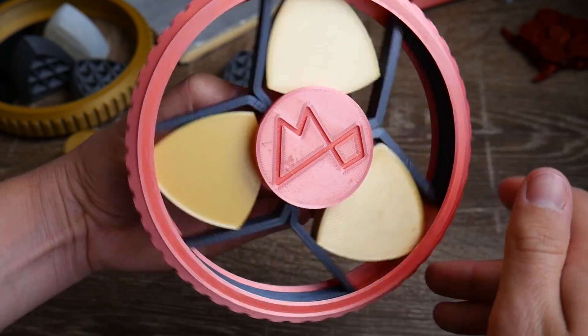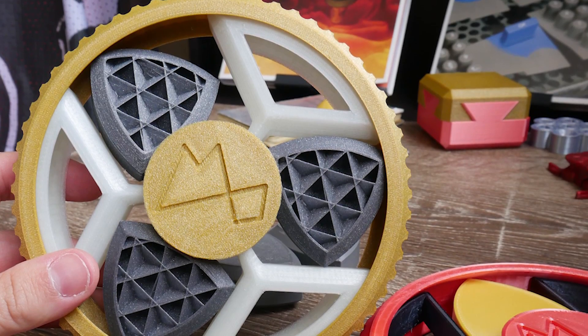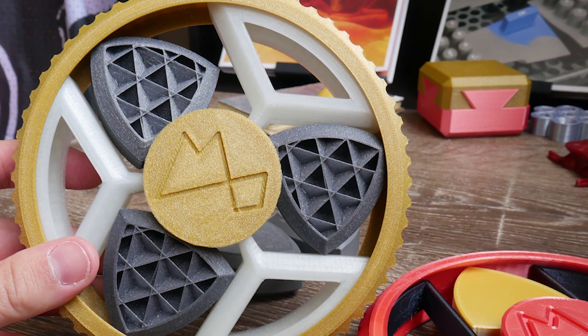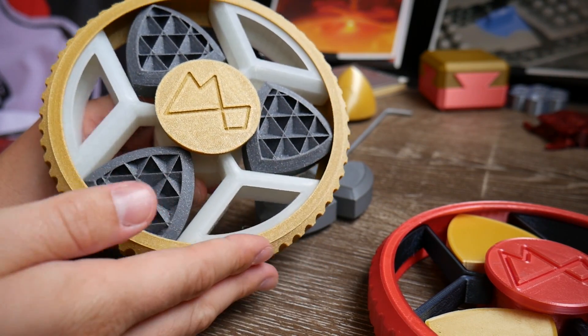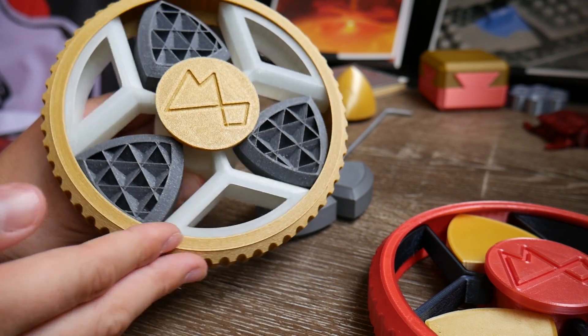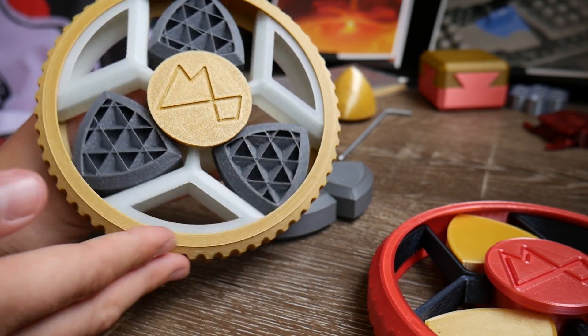They do roll occasionally but not constantly. Their center of mass means that the force of getting past each sharp angle was much harder than simply just sliding, and they also have to revolve up against the edge of the bearing cage itself which makes it even harder to rotate. I had a go at extending the faces up to mate with the 45-degree bearing overhangs in an attempt to create more surface contact and thus more friction. But in the end, not really — this was not a route that was working as well as I wanted.